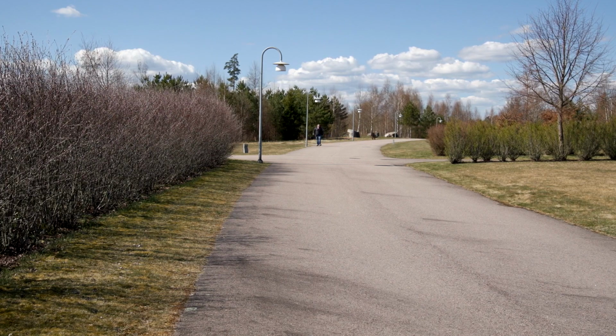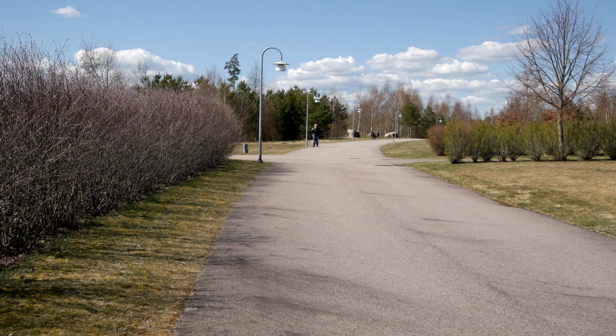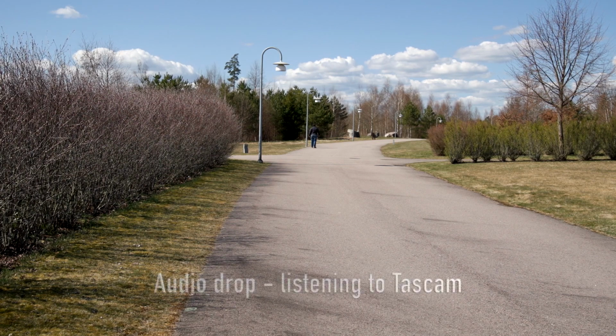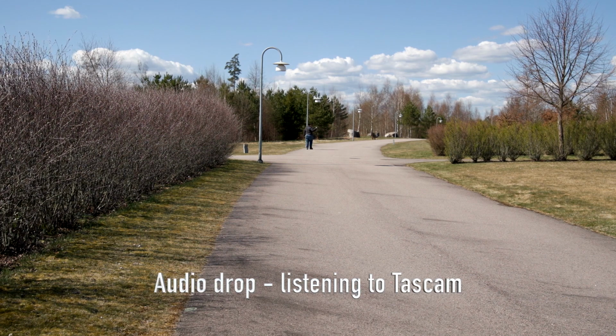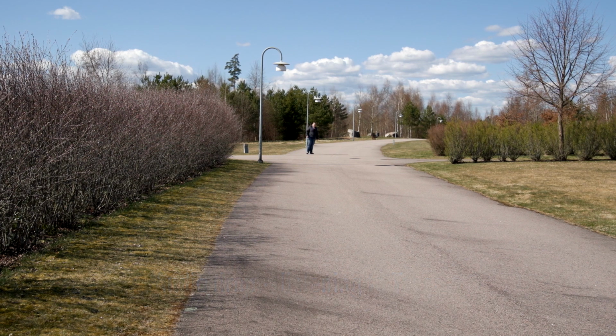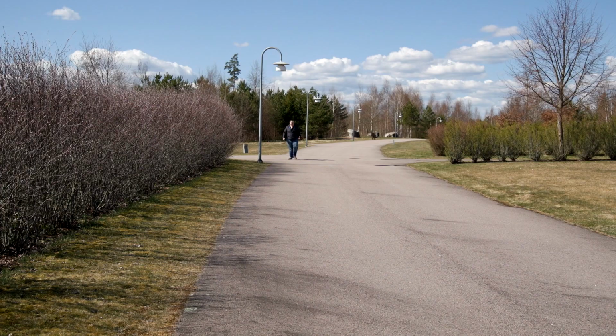All right, now we're closing back in on 50 meters. Julia, I'm gonna turn around and you tell me if you still see audio. All right, so I've turned around now. So this is 50 meters without line of sight. It looks like Julia says it's good. So the transmitter's right on my chest, so I'm blocking the RF. Oh, lost it there. Yeah, so you do get a little bit of droppage, but again, it's a pretty strong signal. These 2.4 gigahertz microphones do great.